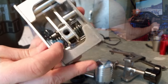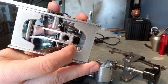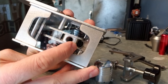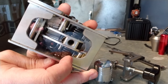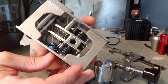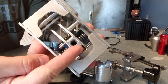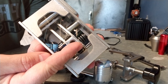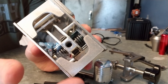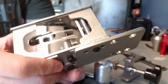And then of course on this side, there's another metal or stainless ring, which actually is threaded for a screw on the inside. And that's where the other part of the spring goes. So it's a condensed design that they thought of, like, hey, I'll go ahead and secure these side plates together with this one, and then I'll position this spring in such a way that it will utilize these rods to have its stops, right? So well thought out, actually, I think.